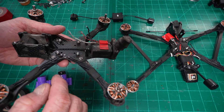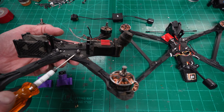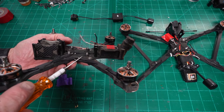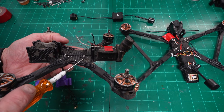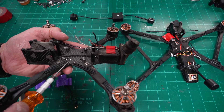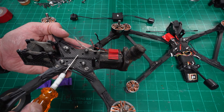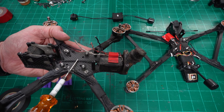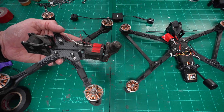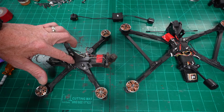On the actual cable, I run my ESCs a little differently because I dampen everything. I have the standard Apex setup with the ESC bolts — the short style — with a plastic nut and a silicone washer to separate the ESC, because I've had ground-out situations in the past. This prevents that and also creates plenty of space to run your O3 cable, which I've done to avoid severing and tearing up the O3 cable.